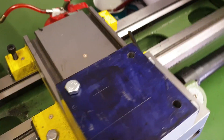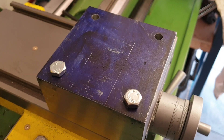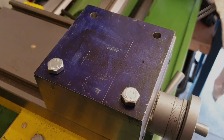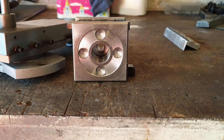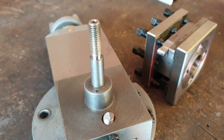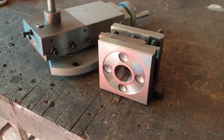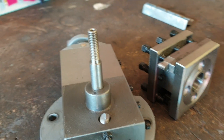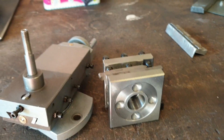Then I've got to think about how I'm going to remove round about three millimetres from the thickness of the top plate — it's standing too tall at the moment. You can see there where I've marked out the centre point for the tool post. Looking at the tool post, we can see on the tool clamp that it is recessed — there's a large diameter recess in the bottom which corresponds to the shoulder on the compound slide. So when I machine back the top of my top plate to bring it down three millimetres, I am going to leave a corresponding shoulder — as we have here on the compound slide — which will give me a register for that tool post to be firmly seated against when mounted on my fixed base.